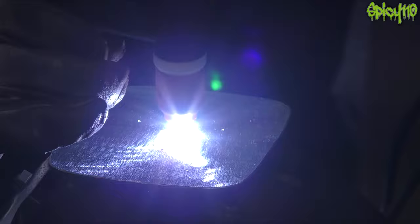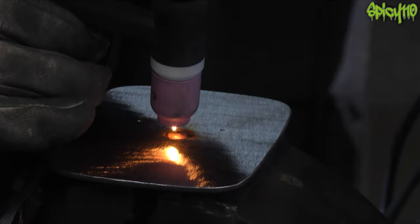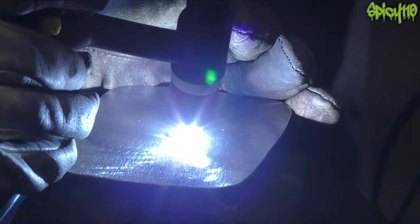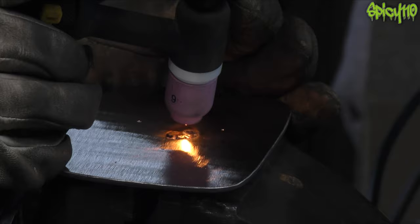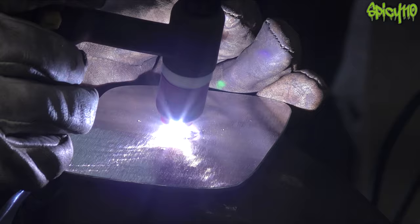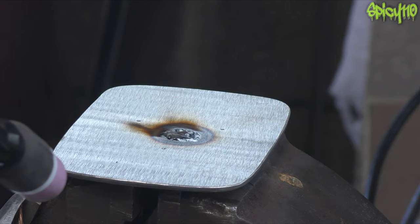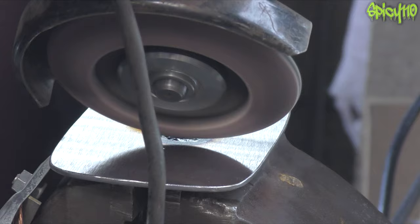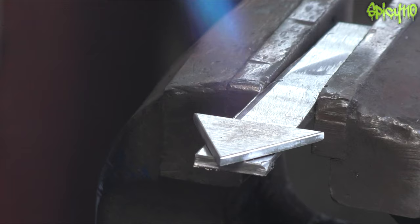Now the button itself — that was about 10 minutes of trying to find my welding stuff. Warming up the standoff post to get it up to temperature before moving on to the thinner material: you need to heat up the thicker materials so they both melt at about the same time, otherwise you'll blow holes in the thinner stuff. Getting a little tack, then filling in — I'm not trying to make it flat because I knew I'd grind it. I was hoping the standoff would flatten out more but it didn't, so I filled it and will get the grinder to sort it out. I was planning to put the triangular play button over the front anyway, but when cleaning up I went too far in one direction so I had to go back over it to completely correct the pattern and get rid of that mark.